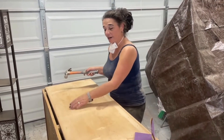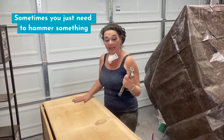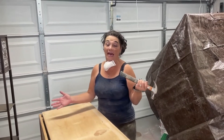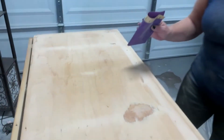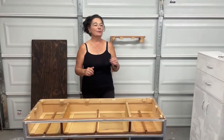I decided to go with a distressed look. We've been playing around with hammers, chisels, and sanders, and the good news is we got all the adhesive off. To save the top we're going to go distressed, so I've been beating the heck out of the piece and then I'll go back over it with finer sandpaper. We'll see what it looks like once we get stain on it.